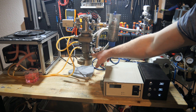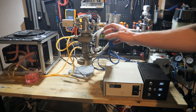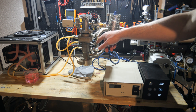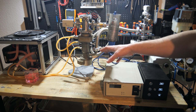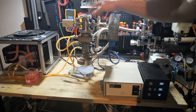The roughing pump is connected on the side of the diffusion pump right here. This is necessary because diffusion pumps only work at an already applied vacuum — they just lower the pressure even more. If they are turned on at atmospheric pressure, the oil inside will probably catch fire or at least ruin your vacuum system because the oil will boil over and get everywhere.